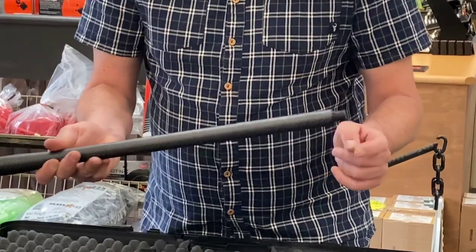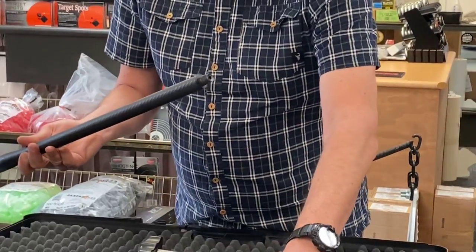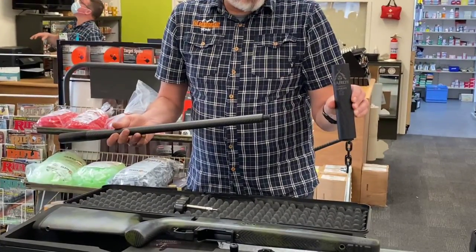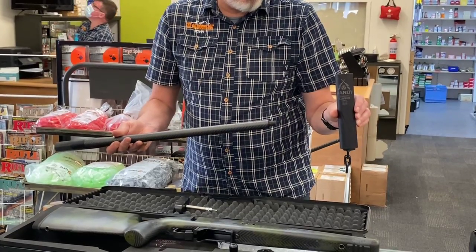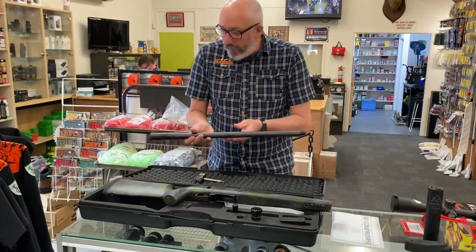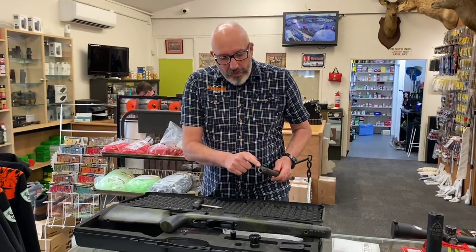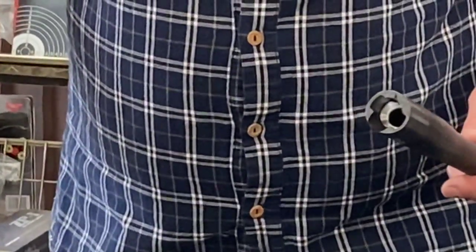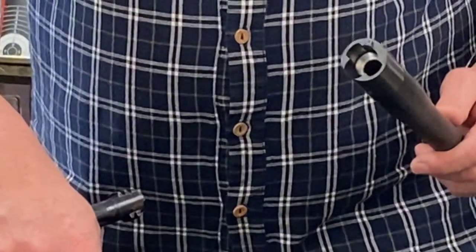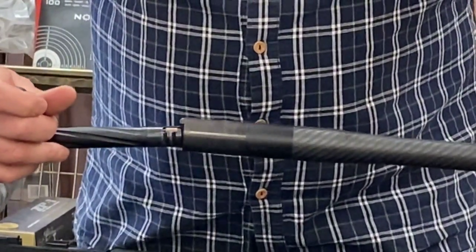You can see it's threaded. In the kit comes a thread cap if you don't want to run a suppressor, but we've chosen to get it supplied with a Hardy covert suppressor, which gives a really nice reduction in sound pressure and isn't too big and bulky. The barrel itself is very clever — the barrel shank has a built-in receiver area for the bolt to lock into. This means we can make a lightweight receiver on the action because all the strength from the lockup comes when the barrel and the bolt lock together.